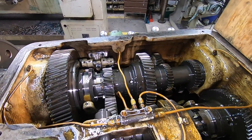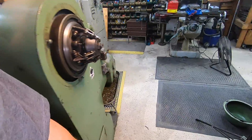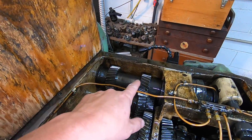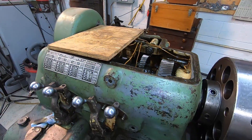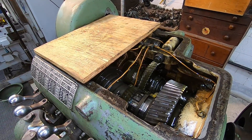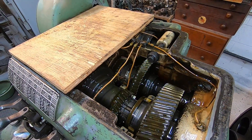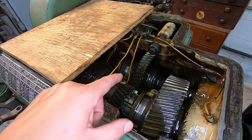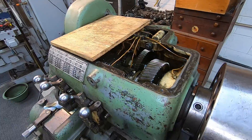There's a cover right here that says 'grease clutch pulley once a year.' I removed this and there's a grease fitting in there - I pumped a little grease in to see if maybe that was the issue, if the grease was dry and it wasn't sliding like it should - but that hasn't corrected the issue. So I think we're going to have to go ahead and go into the clutch and take it out. The manual says to clean the clutch if it's sticking. These machines were very well engineered and designed to run a lifetime. I've got to put this board down here because these gears really want to sling oil, but we'll run it in the lowest gear. These lathes run in an oil bath.